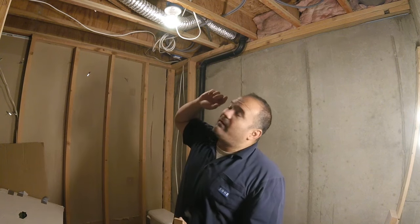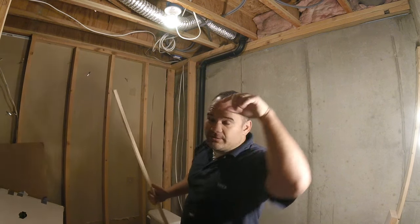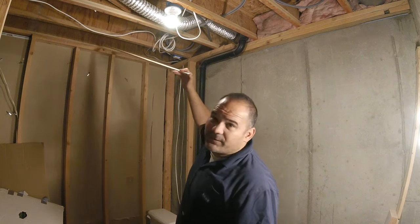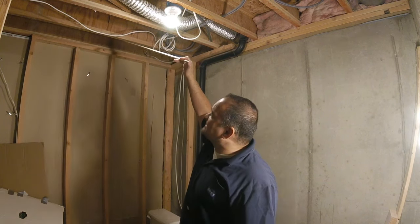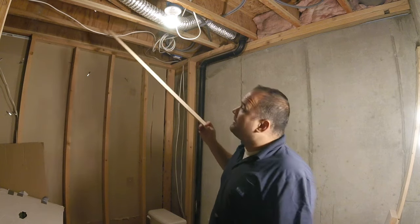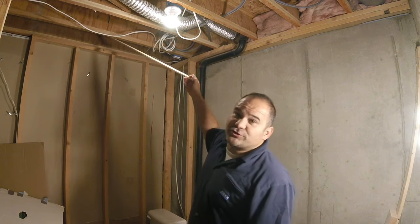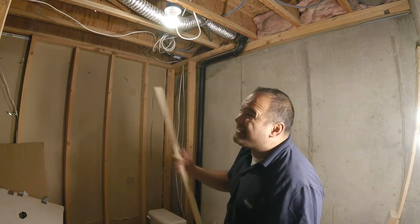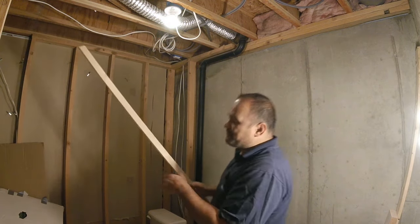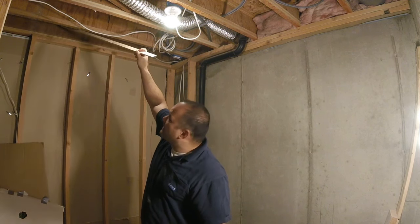What we're going to do is take the wire from the attic, it's going to go through my master bedroom wall, then punch through the bottom plate in that wall and pop through into the ceiling space of the basement. I've done some measurements and I think that ceiling space is going to be on the other side of this joist right here. These beams hold up the floor - they hold up the ceiling down here and the floor if you're standing on the first floor. We call those joists. So on the other side of this joist space is where we're going to punch through.